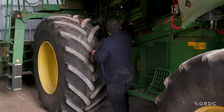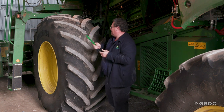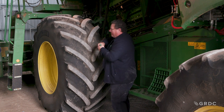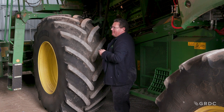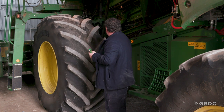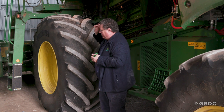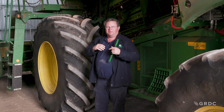The bigger the gap here, the more material falls onto the sieves, and the harder the sieves and repeats need to work. We need to thresh as hard as we can in the concave area. On the Class 8 and 9 machines, we've got nine extra spots on the rotor to put nine extra elements onto it — and that is something we do on our machines, putting nine extra elements in.